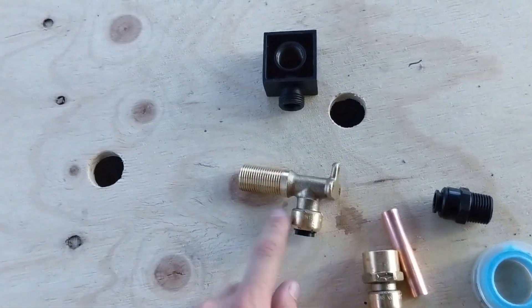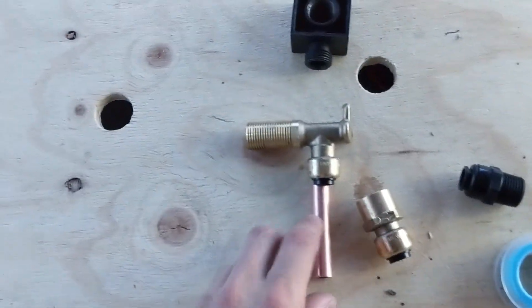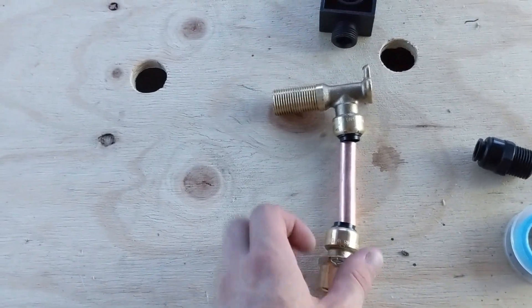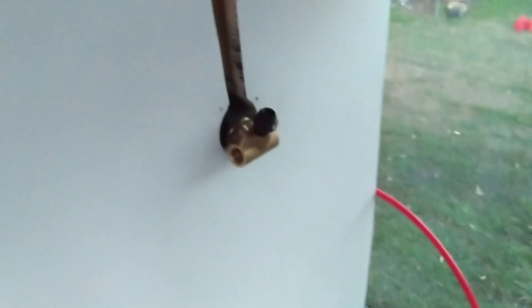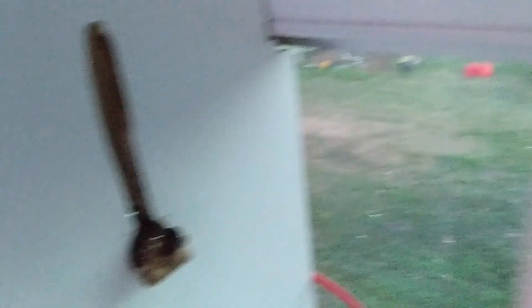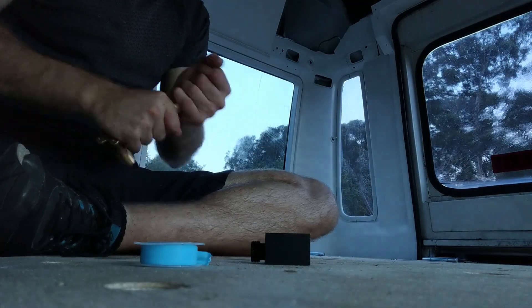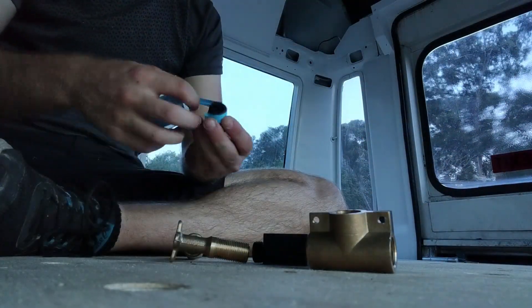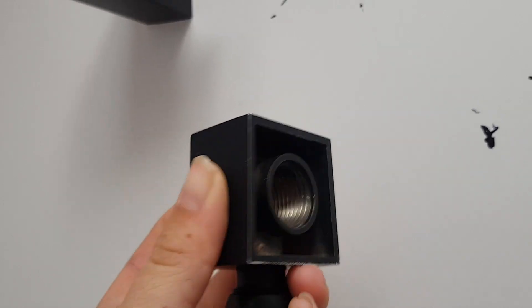This is the piece of our shower head that connects to our water inlet. We weren't sure how to connect it to the shower, so what we've got is this: it goes through the fiberglass and then screws onto the wall. We've got a little bit of copper that goes into there, then this pushes onto that — it's all just push fitting. We've got a half-inch to John Guest that screws into this, and another half-inch to John Guest that screws into the top. Then we'll just do John Guest between them, and that will allow our water to go from cold and hot up through to our showerhead. I'm about to drill out the hole for our showerhead fitting.